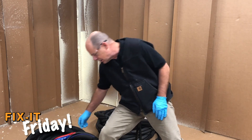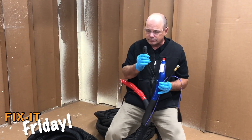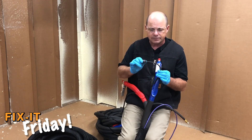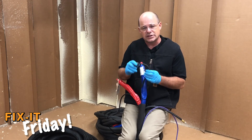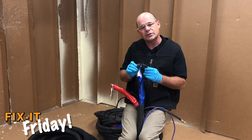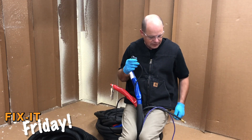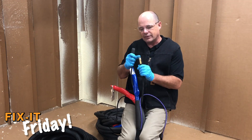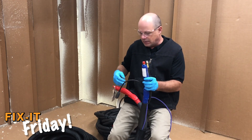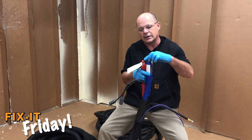All the PMC hoses are going to come with the electrical bolt connectors — they come with two of those. The black line is your voltage line; that's where the heat is drawn through the hose. These run all the way up to the whip end where the circuit is created. You'll have a male and a female end to the air lines, and you'll notice the A and the B lines are capped with male and female ends as well.